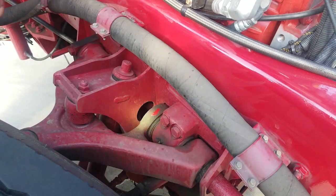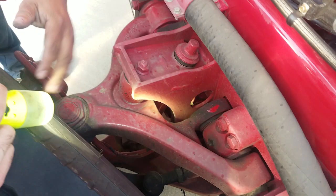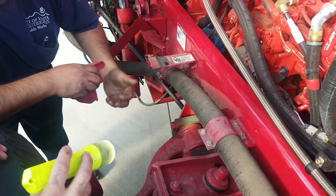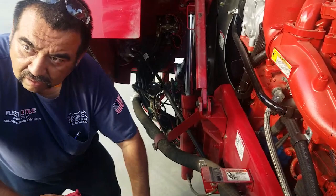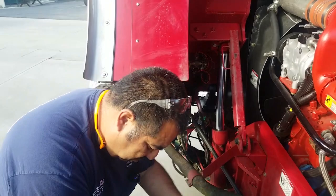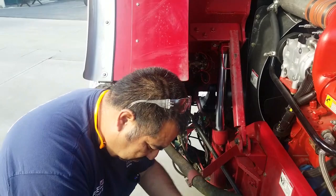Just follow a path — from the suspension down, around, in a way that you can develop a routine and flow pattern for checking everything. From the suspension to the spindle, springs, steering boxes, and on to the brakes.